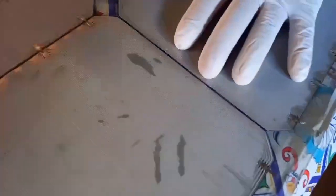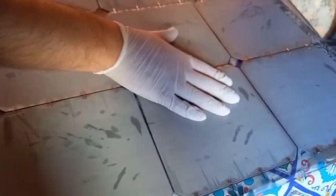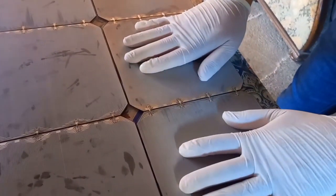Now we are adjusting the cells so they are aligned properly. Do it with special care because it can break the cell. It can cause tension between them and weld contacts between cells can be compromised, so be gentle in this task. Take special attention to the space needed for the bus wire — on the top you need three centimeters and on the bottom only one centimeter.